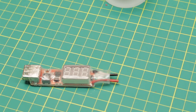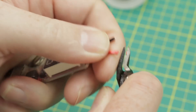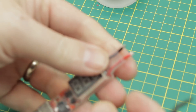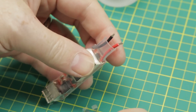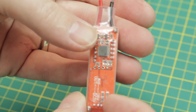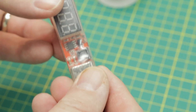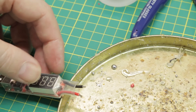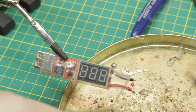My plan is to take this buck converter that I've got here with a USB connection on it, and simply add an XT60 connector. Then we'll be able to power just about anything out at the field, within reason. We can't do really high amperage stuff — I think the buck converter isn't rated for crazy high amperage, maybe three or four amps. It's rated for input up to 26 volts out at 5 volt DC. It'll be plenty good enough for a soldering iron and charging my phone. So a little bit of solder, a little bit of tinning action — we'll go ahead and tin these up real good because we're going to need lots of solder on the XT60s.